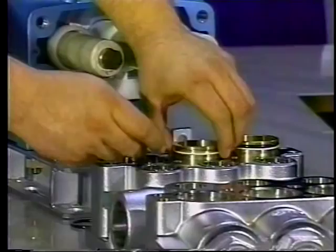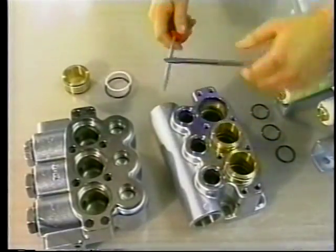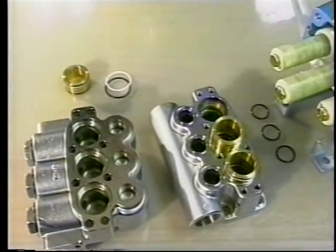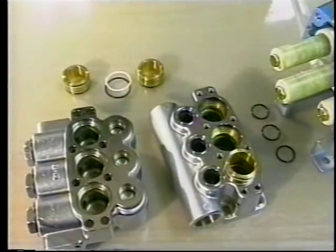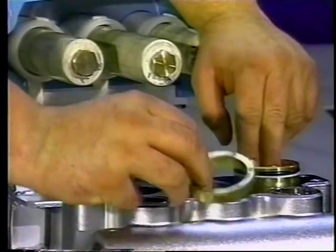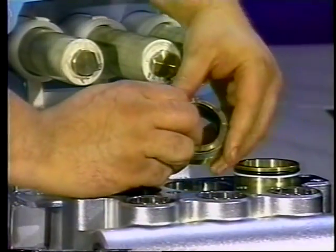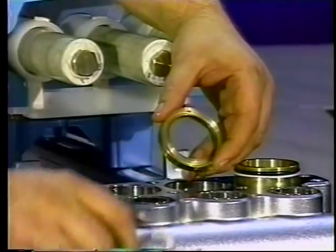Then insert two screwdrivers into the exposed groove on opposite sides of the spacer and pry from either manifold chamber. Exercise extreme caution to avoid scoring the O-ring groove with the screwdrivers. Next, remove the spacer with coil springs from the manifold chamber. With reverse pliers or by hand, remove the male adapter, V-packings, and female adapter from the manifold chamber.